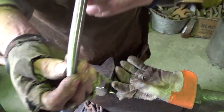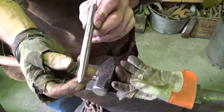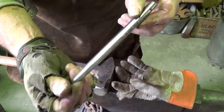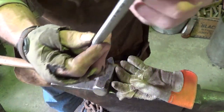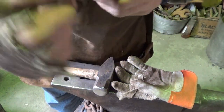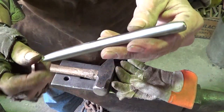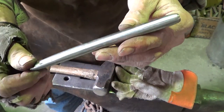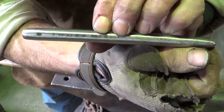Off the grinder — got a nice taper. It's an oval shape coming down to a point on this end, and on the hammering end I also taper back down so I can drive it through. It's the first drift I've ever made — and I think Stanley would still be proud. I picked up a couple of pieces to support it because with the work I did on the head, I can't just lay it right across that hardy hole. My drift is there, my hammer's there — I think we can go ahead and try this.